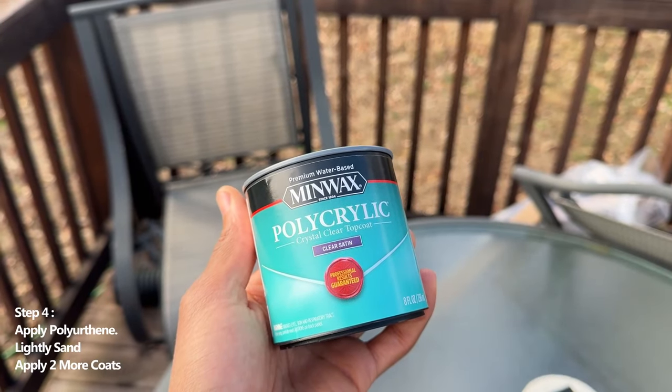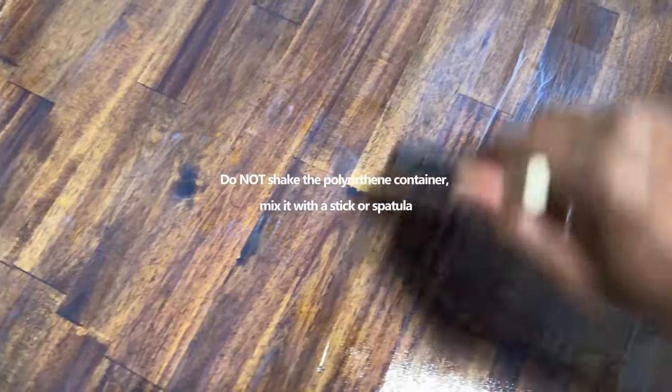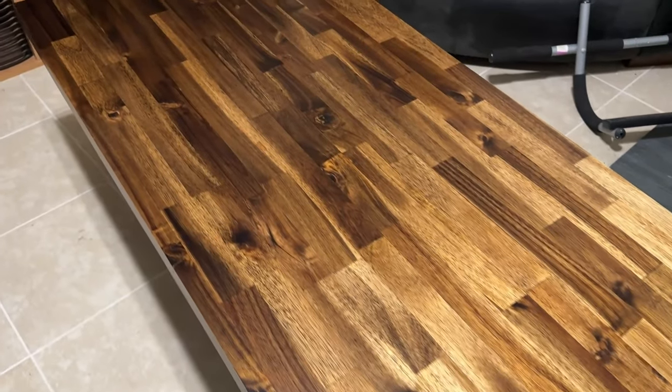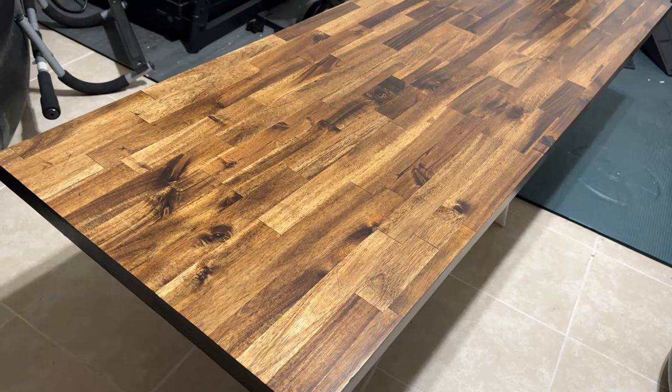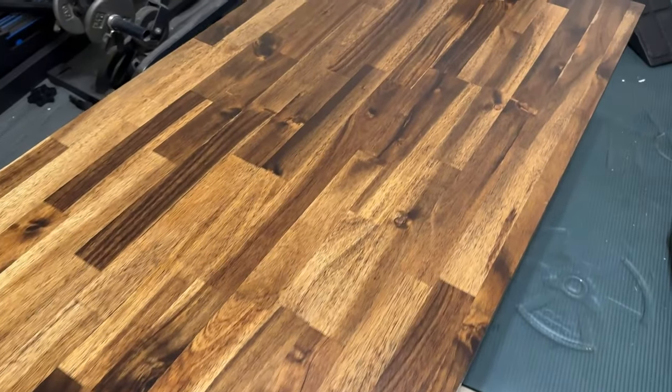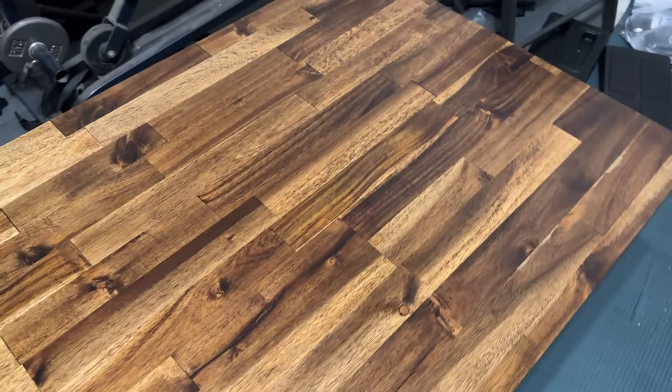After the staining it's ready for the polyurethane. You do one coat of polyurethane, lightly sand it down, then do a thicker coat, and then one more — three coats in total. The polyurethane comes out as a whitish-blue color but once it's done drying it's clear. I forgot to record most of the polyurethane process but there are other videos on YouTube that can show you how to treat a table. One thing to be aware of: be careful with drips on the sides — wipe off that excess. This was my first time doing this and I'm really happy with how it came out.